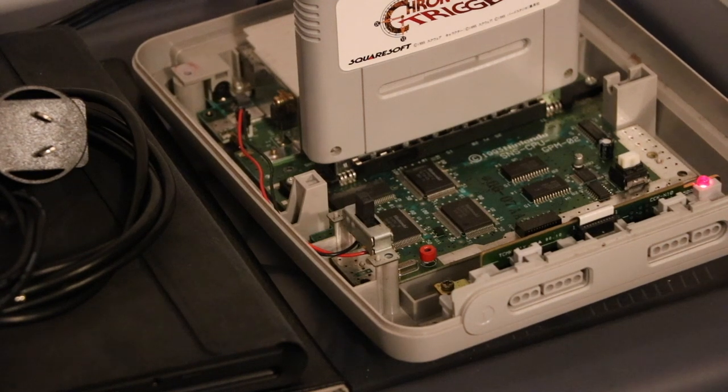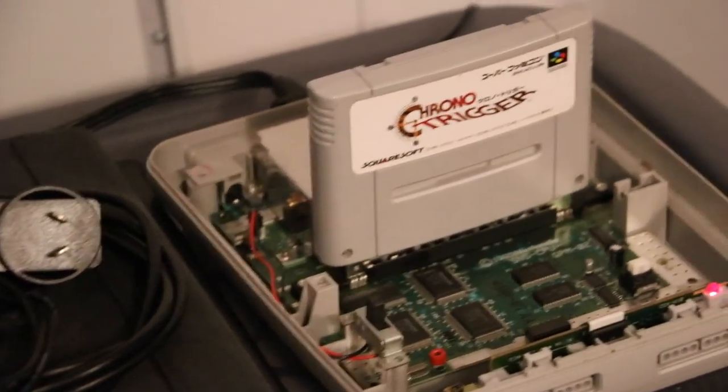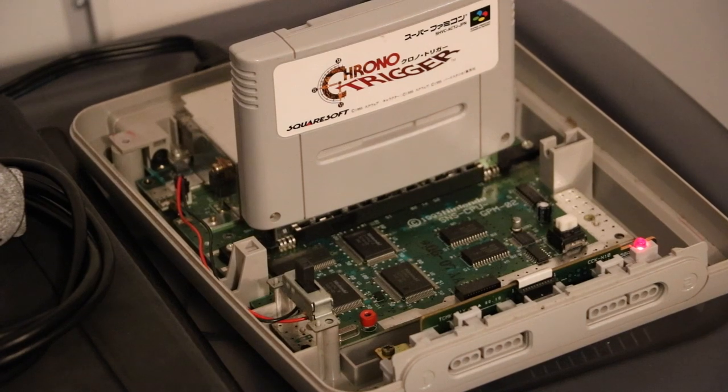And while we've got it in pieces, we can actually have a look at the mainboard, both sides. Make sure there's no corrosion anywhere. No broken traces, which, you know, if we find a broken trace, that's not a bad thing. That's an easy fix. But we'll start with the voltage regulator because it wasn't working the other day, and now it miraculously is. So let's get to the workbench.